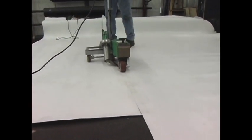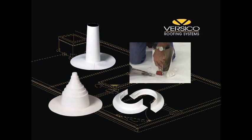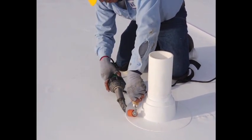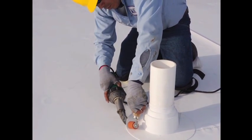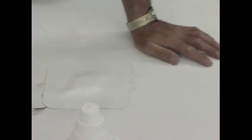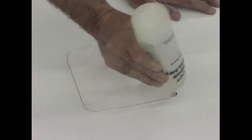Step 4. Complete all splices utilizing an automatic heat welding machine. There are four details which require additional membrane securement: the pre-molded and split pipe seal, the field fabricated pipe seal, and the VersiWeld sealant pocket. These four details require the use of an HPVX fastener plate located 12 inches maximum from the detail. Round penetrations less than 6 inches in diameter only require four fasteners and plates. Pipes over 6 inches in diameter will require fastening 12 inches away from the penetration and 12 inches on center. Heat weld a piece of VersiWeld reinforced membrane over the plate to achieve a minimum 1-1/2 inch heat welded splice past the plate in all directions. After the splice area has cooled, probe the splice and make any necessary repairs. To complete the detail, apply a bead of TPO cut edge sealant to the edge of the membrane.